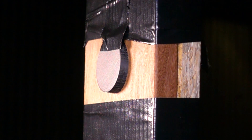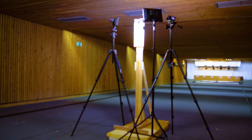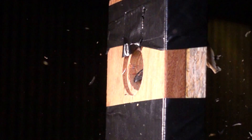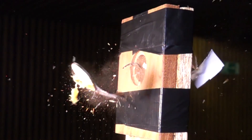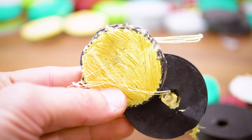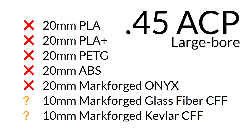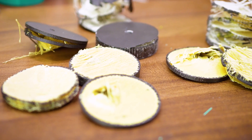Let's finish up with the fiber parts, the glass fiber first. While it looks like it did put up a good fight, ultimately it got pulled through the hole in the wooden holder, at which point the fibers opened up and let the bullet through. But it looks like it absorbed quite a bit of energy — it almost tipped over the stand and got the fibers quite solidly stuck in the hole. We had to remove that one by force. Did the Kevlar part do any better? The Kevlar fibers are softer, so the part simply split in half and the bottom half then got dragged through the hole as a single piece. There's a pretty obvious mark where the bullet hit and it got thrown almost all the way down the range. I don't think we can quite call this a stop. Maybe with a bit more contact area to the holder parts, these fiber prints would actually be able to stop a .45 caliber bullet, but I think even stopping the .22 with a 10mm thick, 3D printed part is pretty impressive — that's just about 3/8ths of an inch of material.